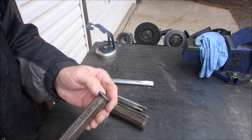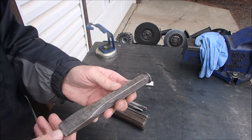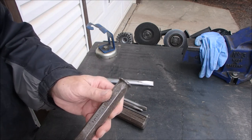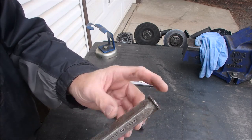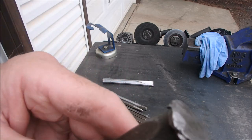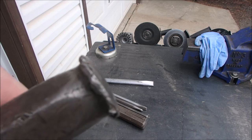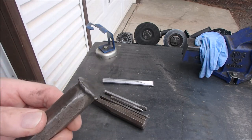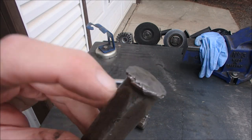This is just going to be a quick video on chisel safety. My brother-in-law was over the other day and he mentioned that when your chisels start to get mushroomed over like this, if you look really closely, there are minute cracks in that mushroom. And these can break off when you're hitting them with a hammer. Look at that one right there — it's almost broken off.